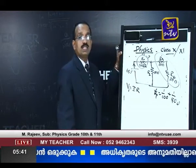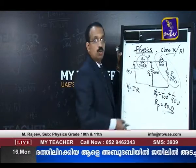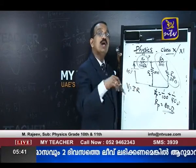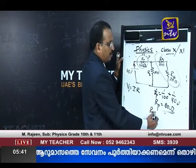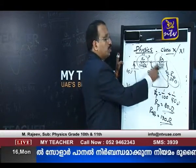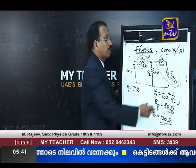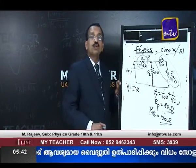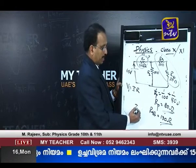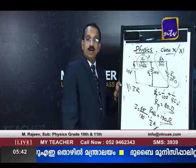After calculating, the effective resistance of that part is 80 ohms — that is 400 in parallel with 100. This 80 ohms is then in series with the 50 ohm R1. Total resistance = 50 + 80 = 130 ohms. Total current = total voltage / total resistance = 65 / 130 = 0.5 amperes.